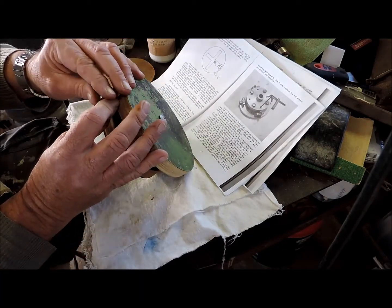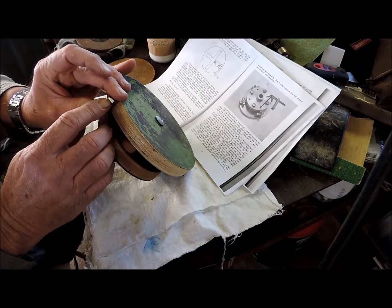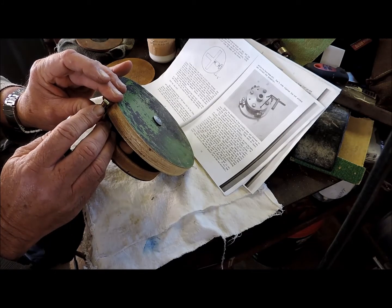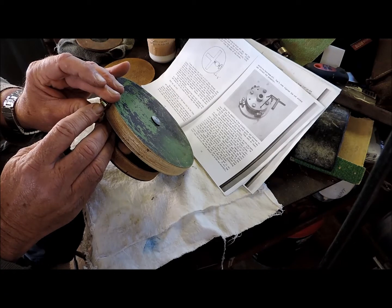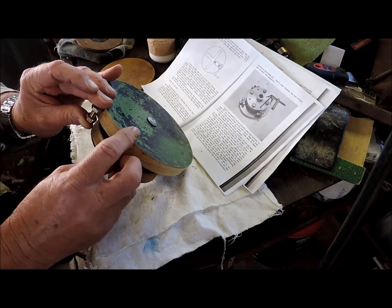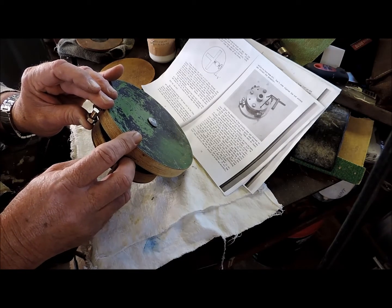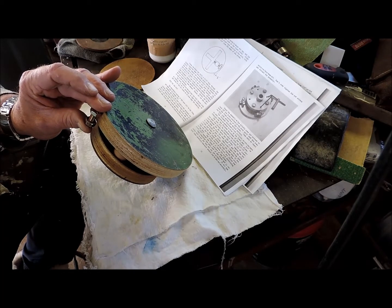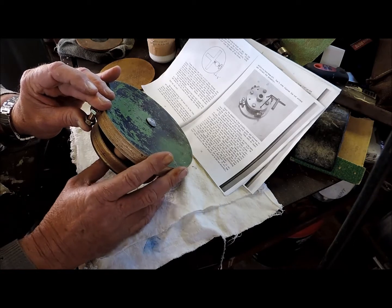And this is about 7 millimeters thick. I make a 7 or 8 millimeter deep, we'll say 10 millimeter deep hole, because I'll put a washer underneath, on a 19 or 20 millimeter board. I'm only hanging on by 10 mil thickness. Not real happy with that.